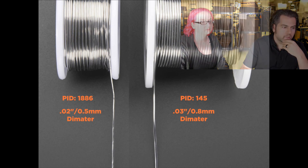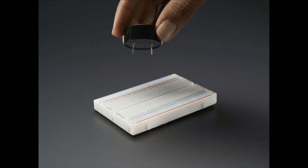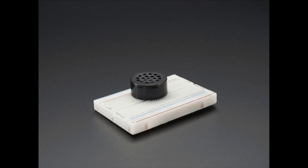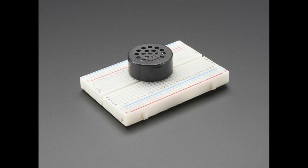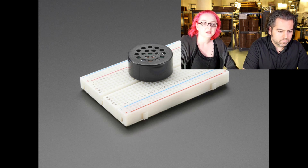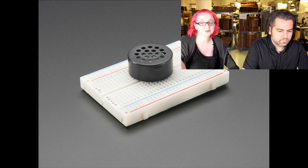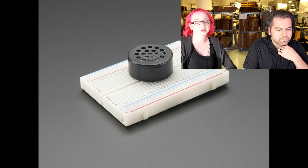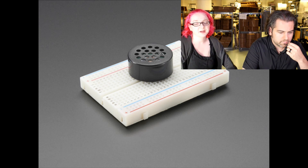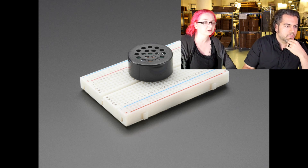Next up, look at this — we have a little animation too. It's a speaker embedded in a plastic casing, which makes it breadboard friendly. This is great if you're doing little audio projects, or you have a speech generator, or you're making sounds or tones, and you want a speaker with a wide audio range — about 50 hertz to 10 kilohertz. It's breadboard friendly, so it's easy to solder into perfboard, Perma-Proto boards, or breadboards. It has a nice protective casing, so it looks a little better too.